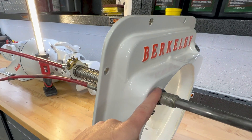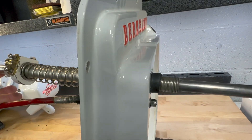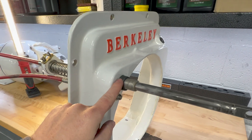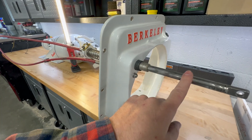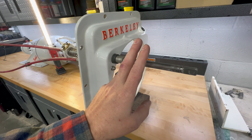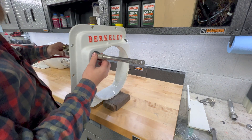One thing I didn't mention is there's a little ball embedded into the plastic plug that prevents it from sitting flush to the back of the transom. The reason for that is to allow it to articulate and give it some movement. That's why there's a rubber piece that comes in on the back side — you silicone it up to the transom and zip it tight around the plug to make it watertight. The o-ring makes it watertight from the steering tube to the plastic piece, and then you rely on the fit of the shaft through the steering tube for that watertight seal.